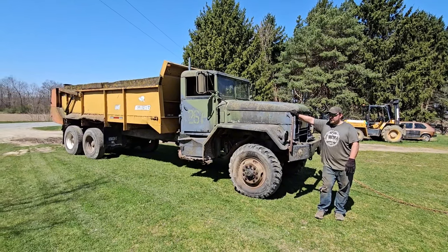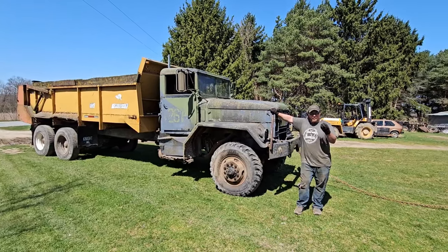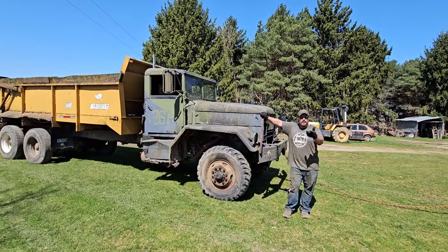But what did we do? We just did points? The ignition system was completely fried. Everything we did, what? Just points or points and condenser? I did points, condenser, cleaned up all the burnt cap, replaced the rotor.